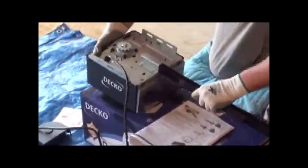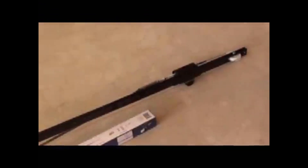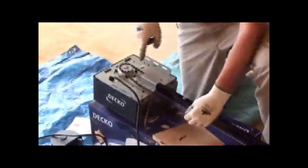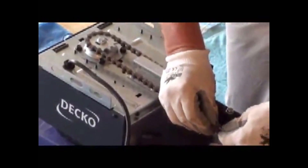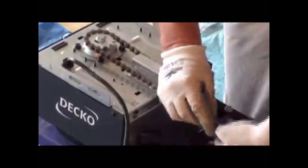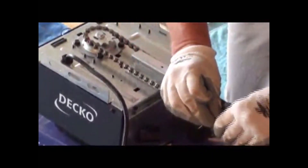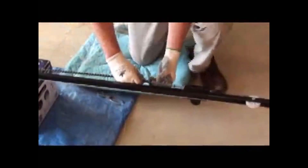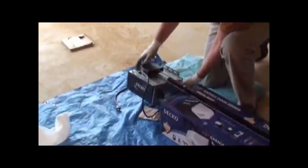Next, you take the chain out of the box and connect it to the carriage. Now you put the rail into the head — you might need a rubber mallet to tap it in, but it goes in pretty easily. Next, you wrap the chain around the sprocket and the drive head. The chain is marked with red — that should line up with the cord. Then connect the chain link to the cable; it just snaps on. You may need pliers for that. Using the adjustment on the carriage, you adjust the chain so it's taut.